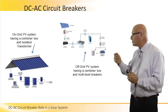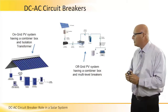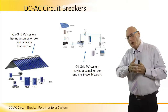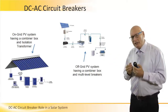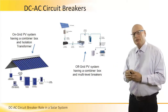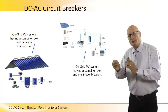Going to the battery bank, the input of the battery bank has a switch and the output has a switch, and it goes to an inverter. The inverter also has two switches, one on each side: a DC switch on one side and an AC switch on the other. This allows us to cut the entire system into segments. When overvoltage takes place in this off-grid system, we want to save and eliminate the destruction of each particular piece of equipment, which is why we have several switches in series — so every piece of equipment is personally protected from overvoltage.